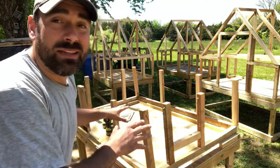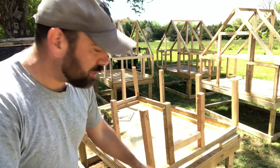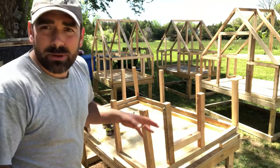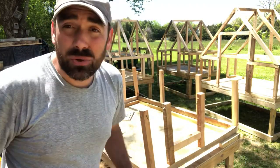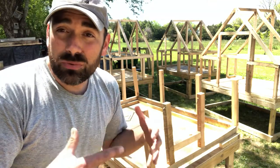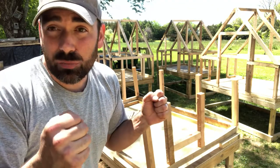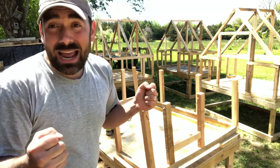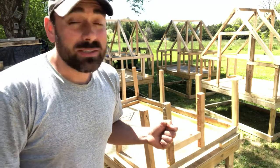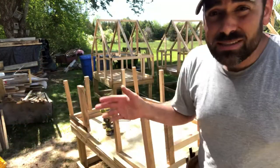We've built this frame, now we're going to flip the whole thing and screw it into the sill plate frame underneath. Things might look like they're rotating — that's okay. This is the rough structure that, once we add the siding, is going to give it the base to hold on to and the rigidity it needs. This is not a house for humans — it's supporting snow, chickens, and wind, so it'll be fine.